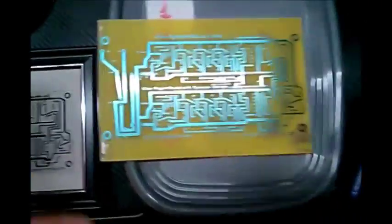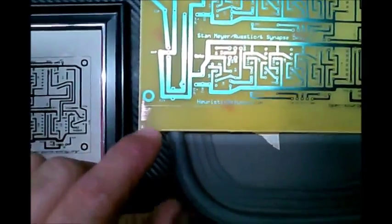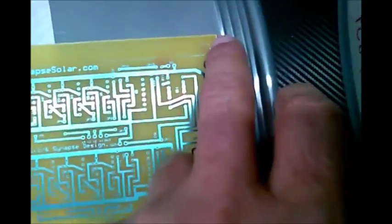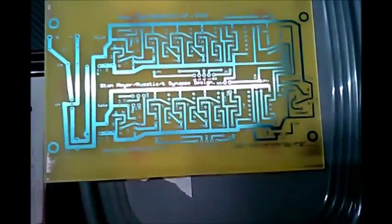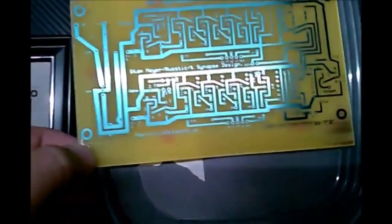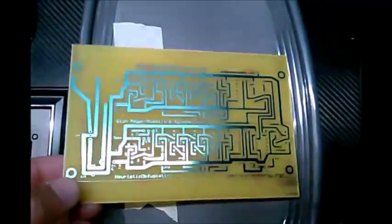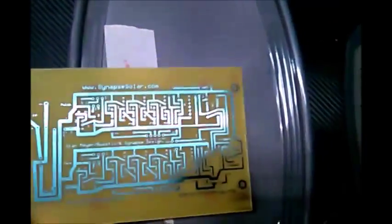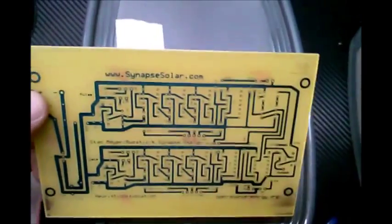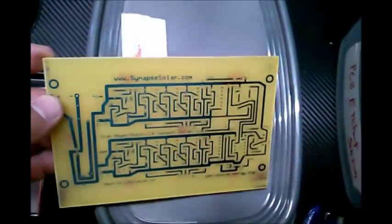On this try, I was afraid of leaving it too long so I was hesitant and took it out prematurely. You can see in the corners where some material was still on there — it didn't fully develop. Fortunately, that section I'm going to cut out with a Dremel. As far as the traces themselves, I think they're in pretty good shape. That's just a word of caution — if this is your first time attempting this, read all instructions and wear your safety goggles and all proper PPE.